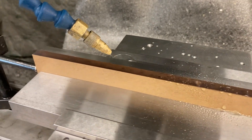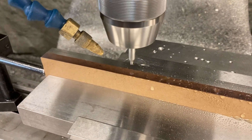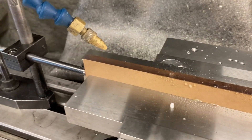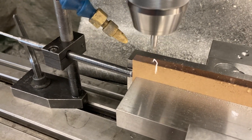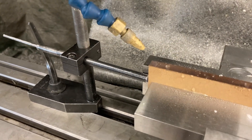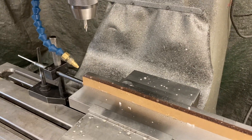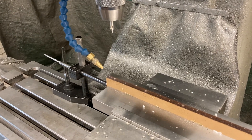When I cut plastic — polycarbonate, ABS, PVC, acetal, black Delrin, polypropylene, UHMW — whatever I'm doing, I have dedicated tooling for it. I use nice sharp tools, brand new tools. So then I center drilled those holes, and I'll go back and tap drill them with a 149 tap drill, then tap them 10-24 by hand.